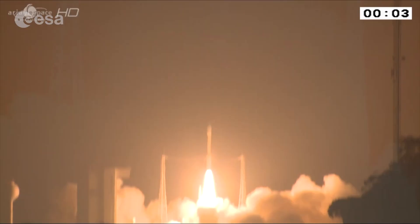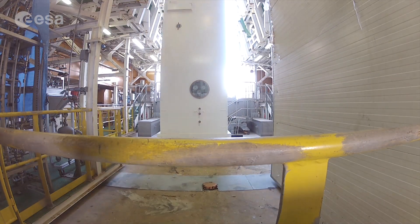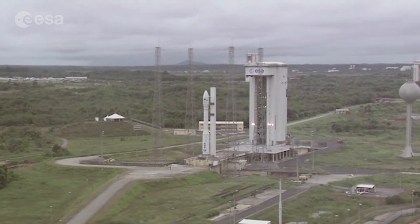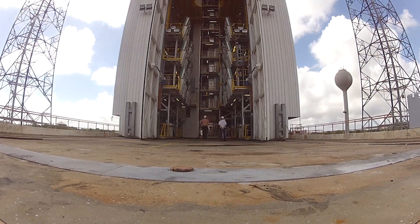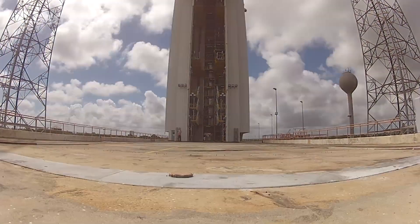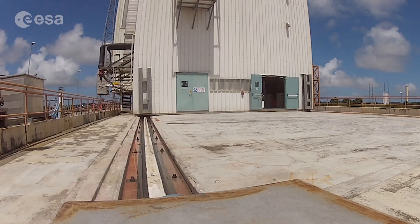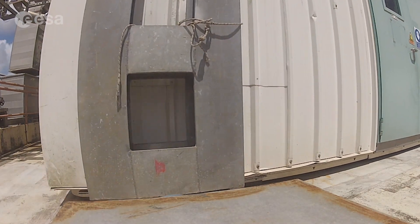The Vega project, which is our new launcher, came to us because they had an issue with their translation stage. Vega is manufactured within a building and then before launch the building is wheeled out of the way and the launcher is free to go. This infrastructure is in French Guiana — that's where all the European launchers are launched from, close to the equator. This big infrastructure moves on wheels like a train, with wheels and rails. Aramis was involved in particular for a problem with the bearings which, after a couple of years of usage, had degraded to the point that we couldn't translate or move the gantry anymore.